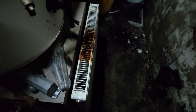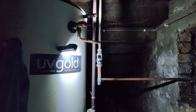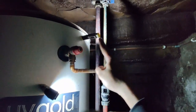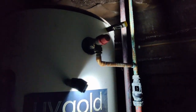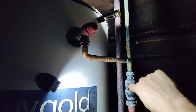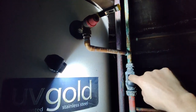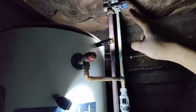The task at hand is to firstly identify which valve is leaking — whether this valve or that valve. Let's just have a feel of this hot water pipe — nice and hot, somebody's using it. If the water in the cylinder is nice and hot, one way to determine which valve is leaking is to feel the water that's leaking. It's freezing cold, which tells us it's not coming out of the cylinder — it's actually leaking from that top valve.